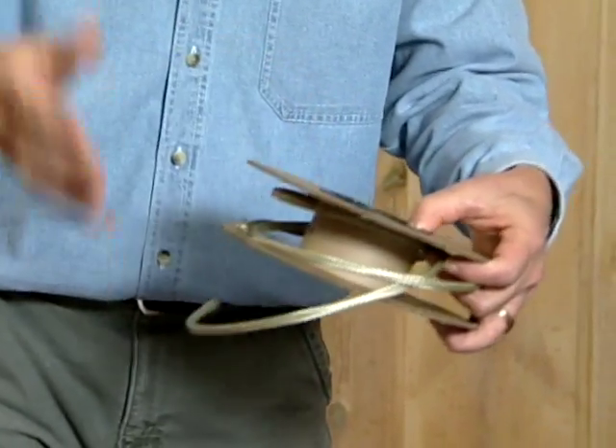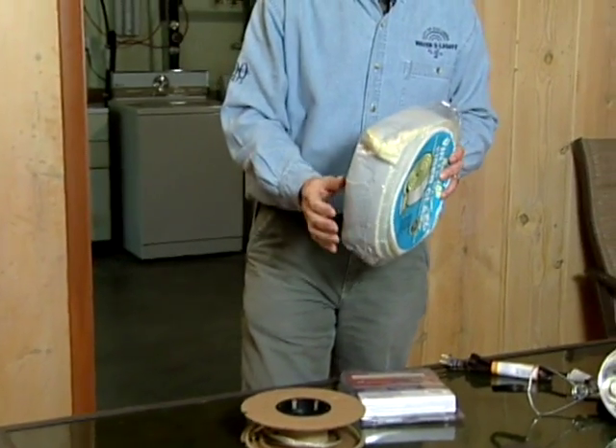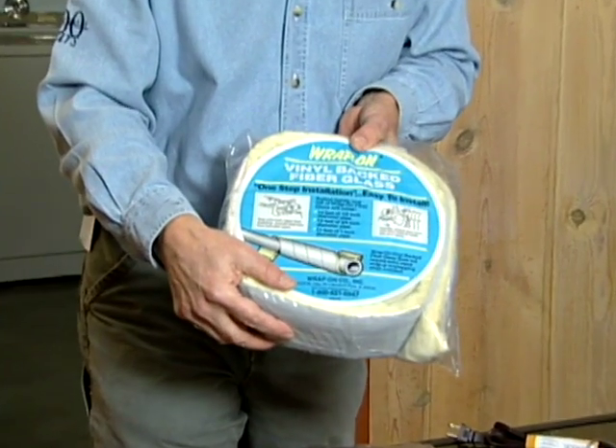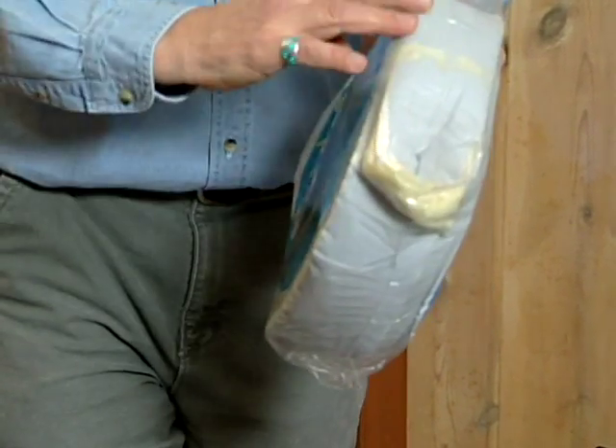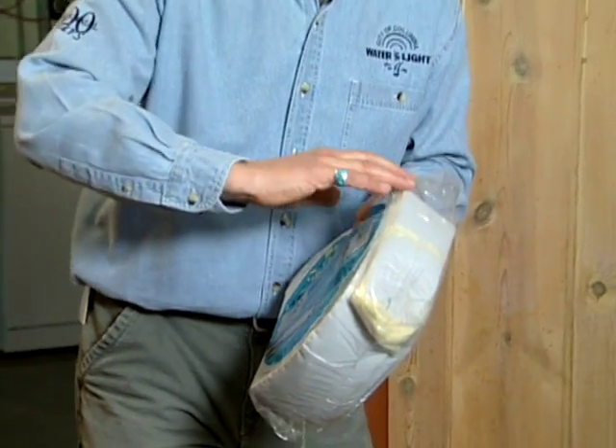You put the connectors on the ends and you can go with it that way. You can also go to plumbing supply houses — they have heat tapes that have been used for many years and are known to be safe. You'll probably need an extension cord to run it to an outlet upstairs, so make sure you buy a cord that's heavy enough to handle the amperage so you don't have problems with the extension cord either.